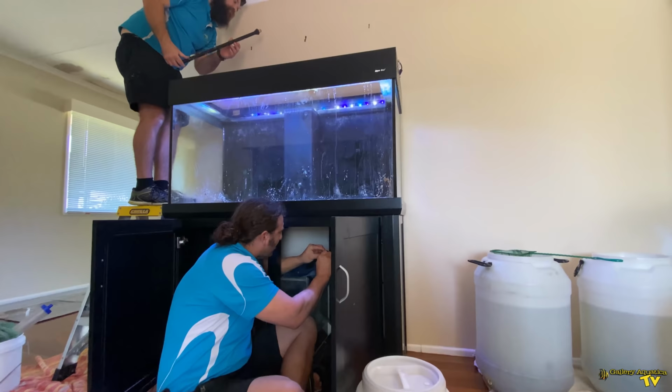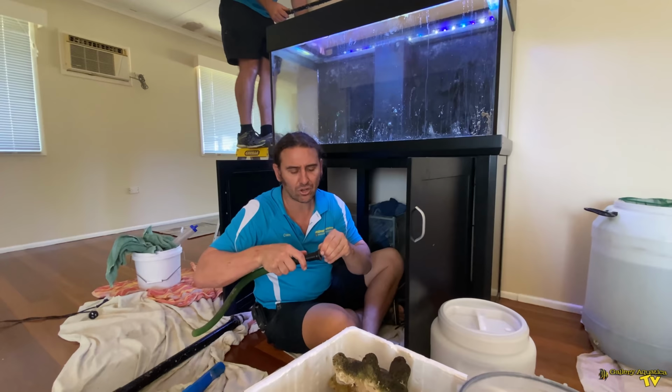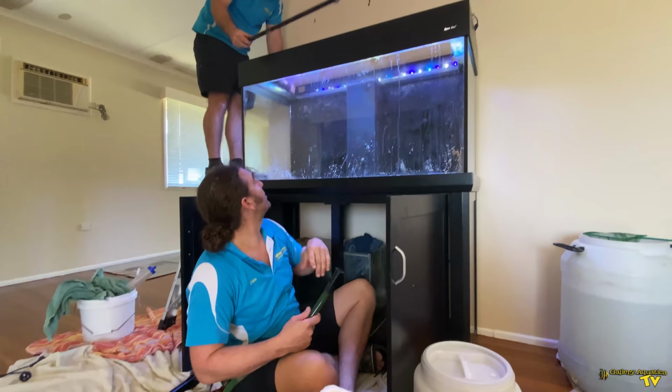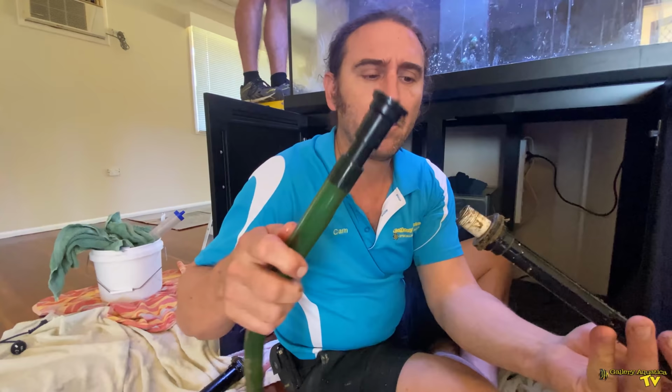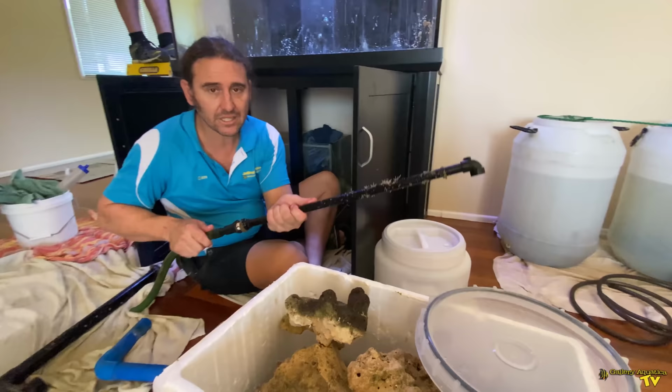One of the most important things is to look for and find the O-rings. So they're a seal, like a gasket, on either side, top and bottom, with both sets of plumbing. So there is an O-ring here. Can you pass me the... And there's another O-ring here. It's hard to see, but what I do to keep these in place is I actually thread this back together and transport it as one. And that way there's no chance of losing these O-rings between this location and the next.